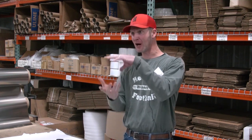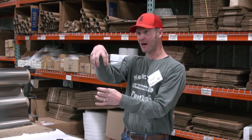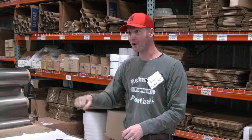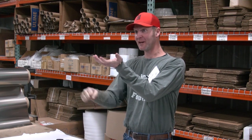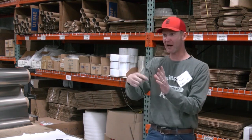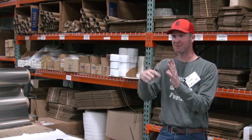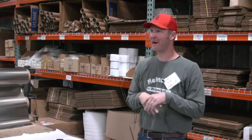It's a Hamilton. It was built back in the 50s. It's on drive cones. It's got a drive cone that comes out, a drive cone here, and a drive cone here. So you move your work table up. The spindle doesn't go, and it goes up, and then whenever you release, it hits on the other cone and self-releases. You can control the torque by hand because the drive cone is on a fibrous material, so you can slip it. That was definitely a game changer for me.